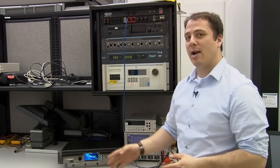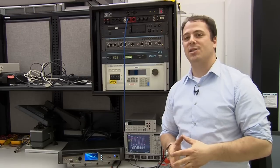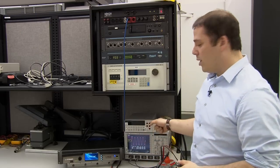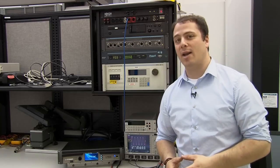Currently we're sitting at about 120 volts, which is US standard power, but we're going to spin this through on a variac and basically demonstrate the range that this thing can cover with a 1K sine wave displayed on the scope here, so you can see that it doesn't affect the audio in any way.